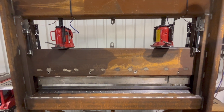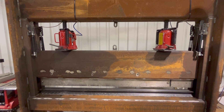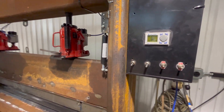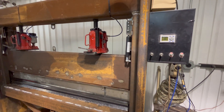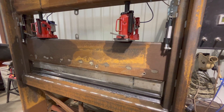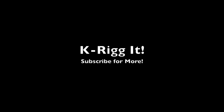So that's it — pretty simple, pretty straightforward, and it works really well. I like the fact that it's not as fast as a hydraulic or mechanical press brake, so it's a little bit safer. I've also thought about switching to a foot switch, because it gets difficult when you're trying to use two hands to hold material and then have to come over and hit the switch. But other than that, it bends 6 feet of 10 gauge easily. I haven't done anything thicker than that at full width, though I have done thicker material in narrower widths. Thanks for watching — subscribe for more, and we'll see you next time.